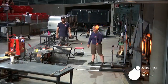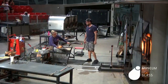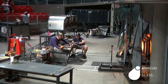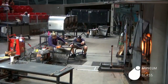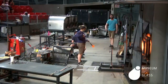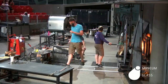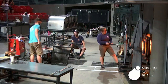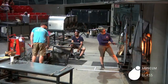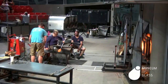Oh, they use it for all sorts of things. They make what's called bioglass that they use to make artificial bones, and it's so loaded up with calcium that your body thinks it's real bone and will grow onto it. They make sol gel glasses for coating architectural windows with low energy reflective coatings. They make a glass called fused silica that they use in the windows of the space shuttle.